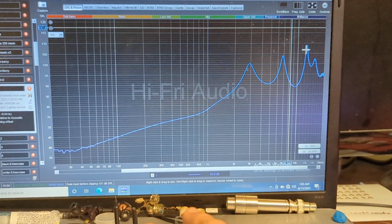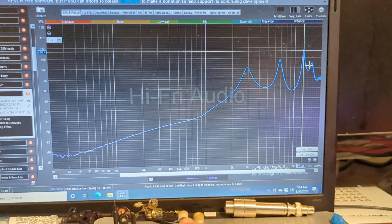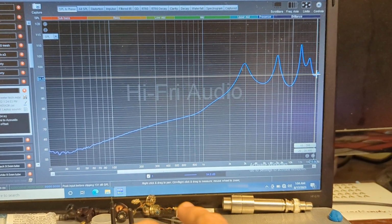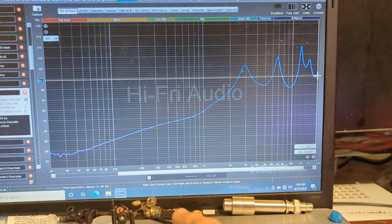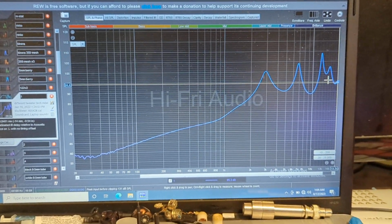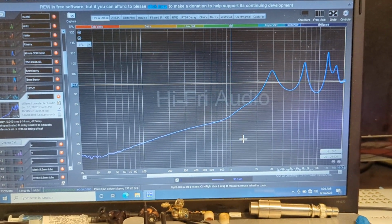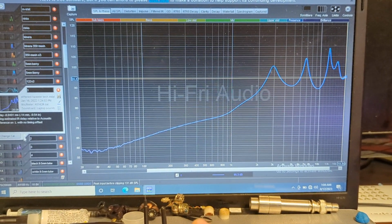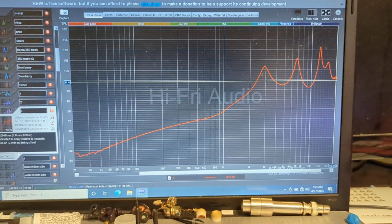It does lose some energy from its highest peak, about, what is that, 108, 102, 94. So it's like 14 dB. But that's still a lot of energy, 94 dB, because I measure all my drivers at the same gain, same output. So 94 dB, that's pretty damn good, even though the driver itself really isn't that sensitive in all reality.